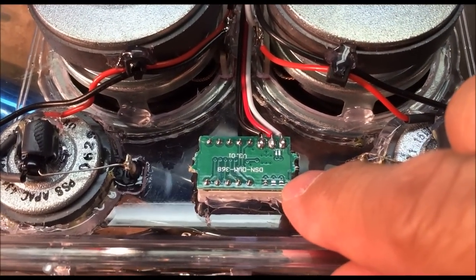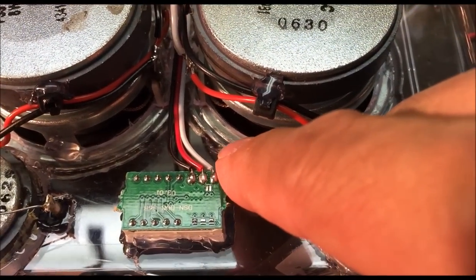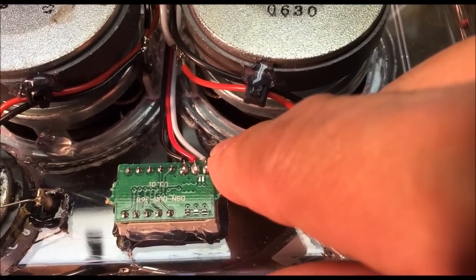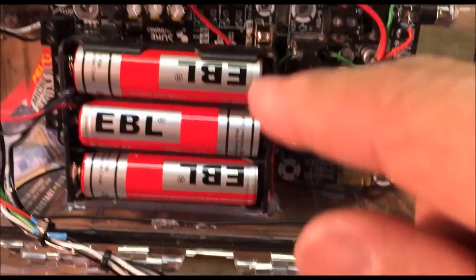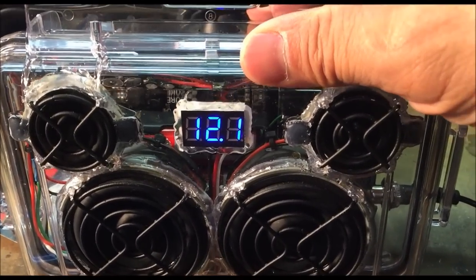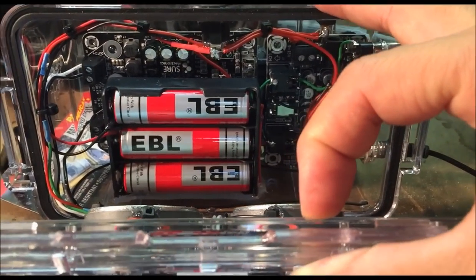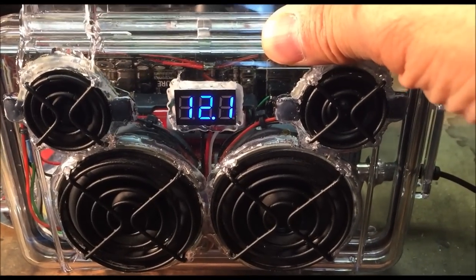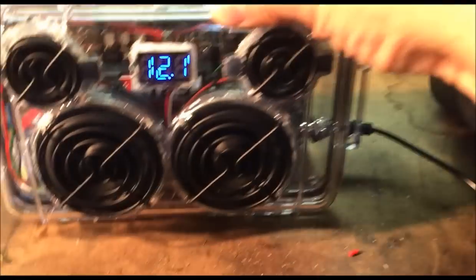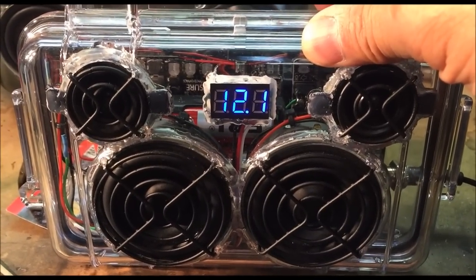With these really cheap voltage displays — I think I bought three of them for about $5 on eBay, though they take two or three weeks to arrive from overseas — there are three wires: black is negative, red is positive, and white can be a switched positive. I simply combined red and white together to the positive center of the switch, which is 12 volts out. Whenever I switch it on, it turns the amp on and gives me a voltage display. With the lithium ion battery fully charged, you should get about 12.5 to 12.6 volts — meaning each of the three cells is at 4.2 volts. I've played this down to about 8.5 to 9 volts, and just like the bigger box, once you get to the low end of the battery it starts to break up with distortion, and this one just powers off.